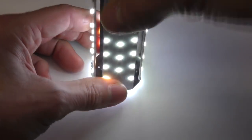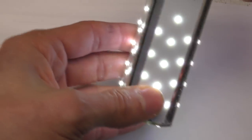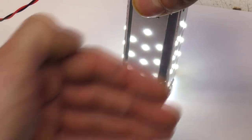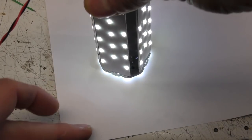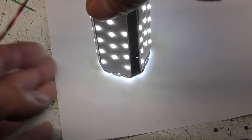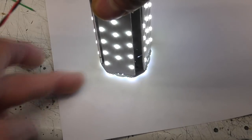And we started off with this parallel to the face of the cube, but we found that rotating it 45 degrees was a little bit more effective, because the bulk of the light was coming out in this direction. So if we fired that towards the corner, because obviously the corner is further away, and as the level drops off towards here it gets closer, that balanced out to some extent. There was another effect. We found a very slight, not so much a darkness, but a slight discontinuity on this angle.